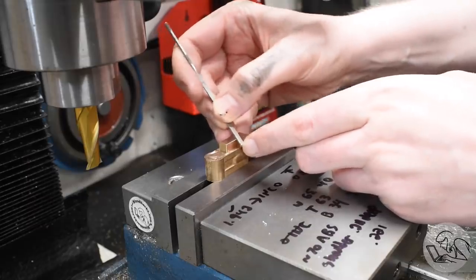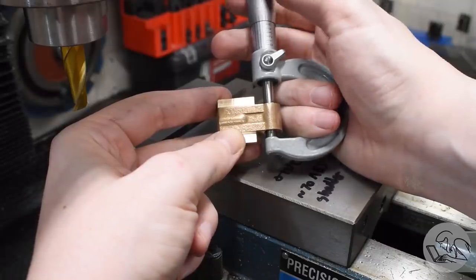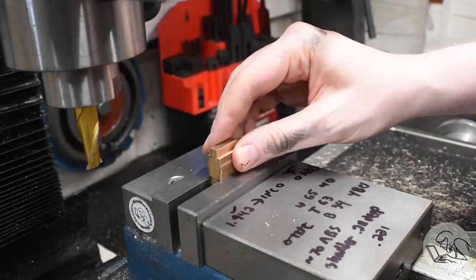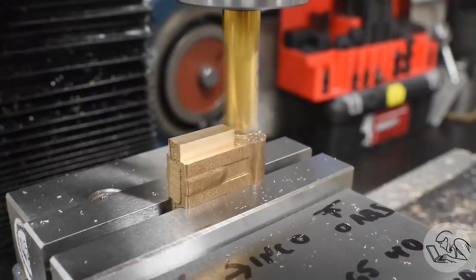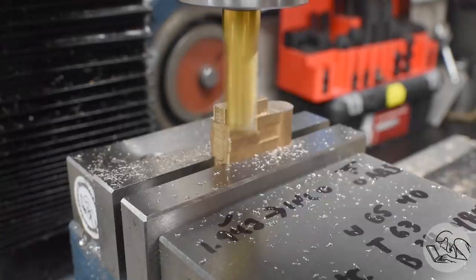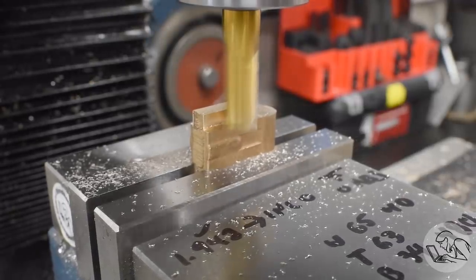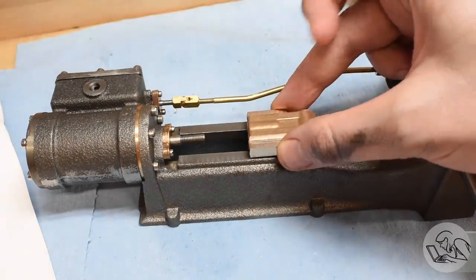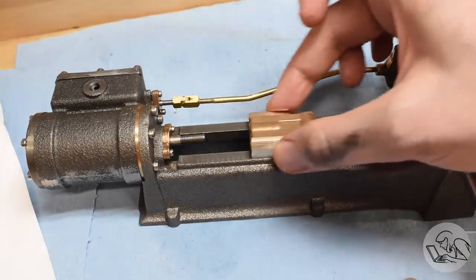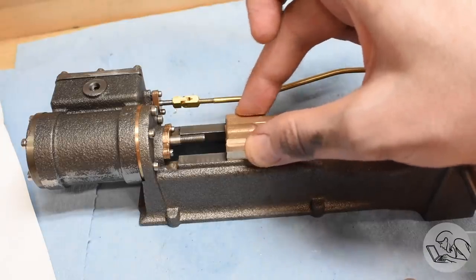A little deburr, and I actually took it out to do my final measurement on the width because I knew I had one more pass but wanted to make sure I was going to end up centered. Sure enough I'm getting a little off-center, so I decided to flip it over once again on the X-axis and do my final pass on the other side. There were a lot of numbers to keep track of for where all these surfaces needed to be, so I had to start writing stuff down. First test fit - oh that's lovely, that fits right in there and slides very easily with no appreciable twist or wobble. I'm really very pleased with that.